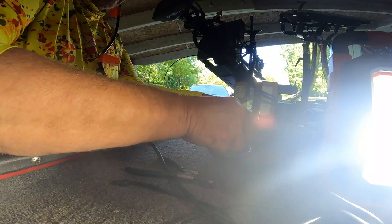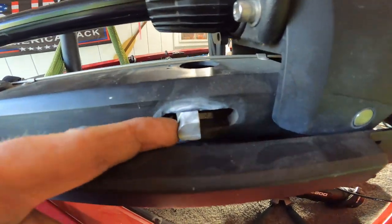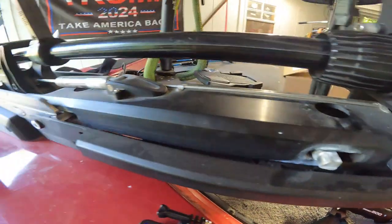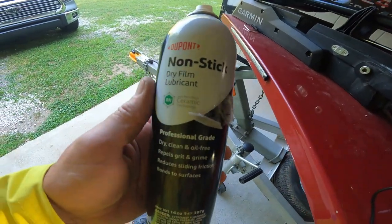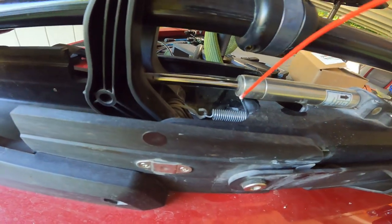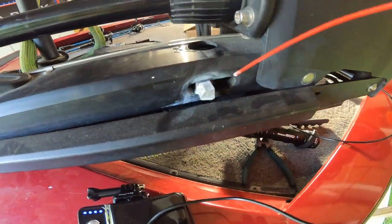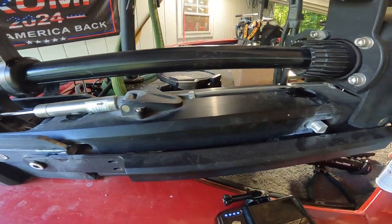The last thing to do is take the handle and put it on. One thing Garmin recommends is these latches right here — you need to put some kind of lubricant on there. You've got a set here and a set down here. I use this — it's made by DuPont, I got it off Amazon, it's a dry lubricant. Hit these springs, hit these latches, both sides. Basically that's the maintenance on your trolling motor right there: keeping it lubricated.